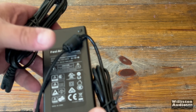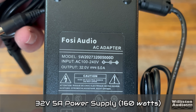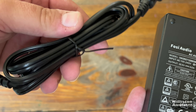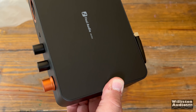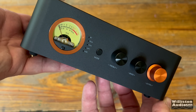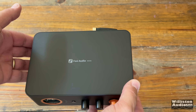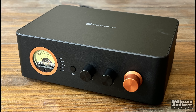We also have the power supply — in this case it is a 32-volt, 5-amp power supply, which is 160 watts total if you do the math. Now, if you know this amplifier has two of the TPA3255 chips, this power supply seems well underpowered to me. But here is the amplifier, and notice the VU meter there on the left. Very cool. It has a slick Fosi Audio design and I kind of like the way it looks.